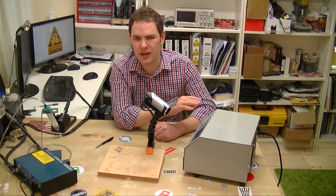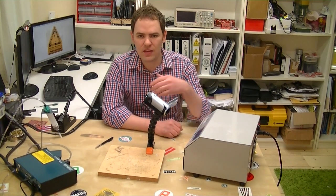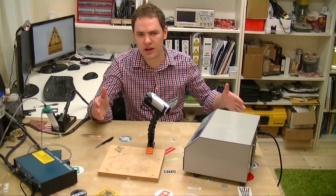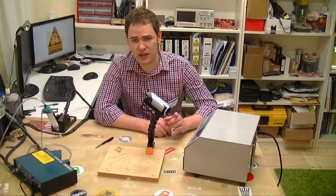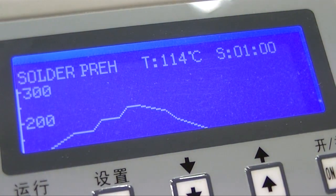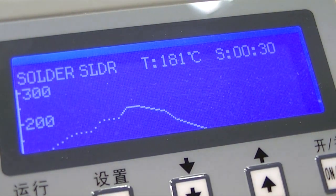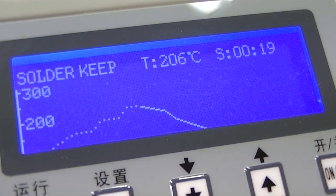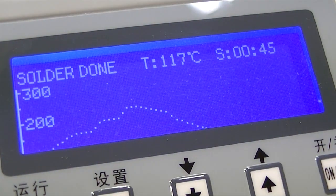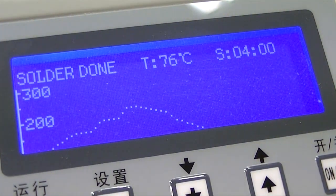It'll take about 10 minutes to reflow this board. Compared to some of the cheap inexpensive models on eBay, this one is a bit better — it has the endorsement of people who use it in production. Seeed Studio has been using this brand for years. One issue I kept reading about with cheap eBay models is that the timer is off — they can't ramp up the temperature enough to meet the heating profiles, so they stretch out the time instead. I've timed this machine as it cooks, and the timer seems accurate within two to three seconds. Another concern is fumes. Many cheap eBay models produce a terrible amount of stinking fumes. I can smell the flux coming off the board as it heats, but it doesn't make any smells that a normal soldering process wouldn't.